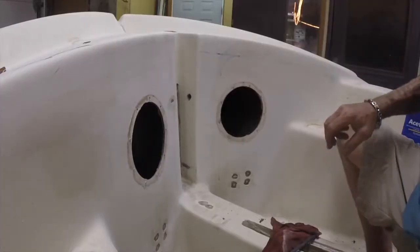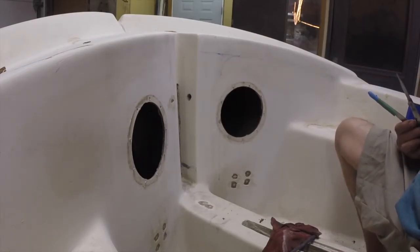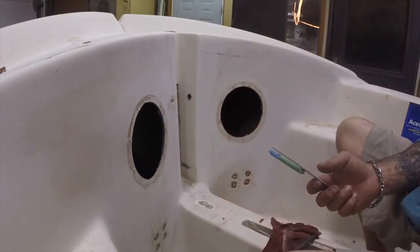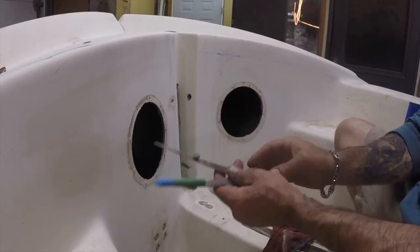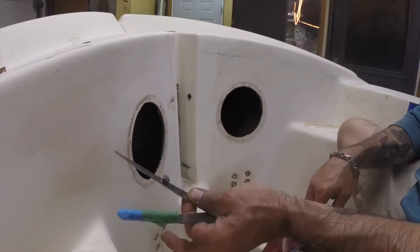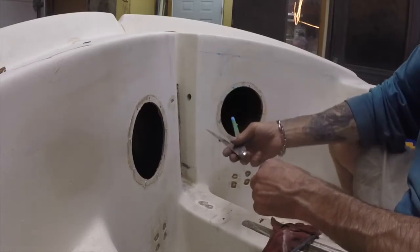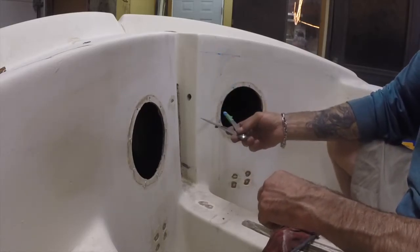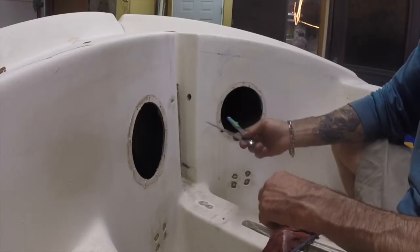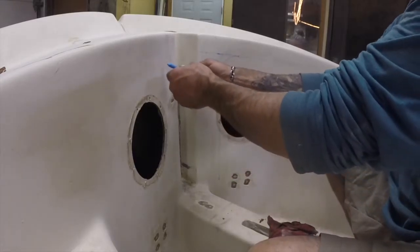So alright, the first thing I did was find some just normal colored chalk, Crayola here, and I took out my Starrett dividers and I taped a piece of that chalk to the dividers. As you can see, it's taped. So for this one, I decided, well, I'll just go to the edge of this hole that's already here. So I struck a line here. I'll show you how I did that, gentlemen.